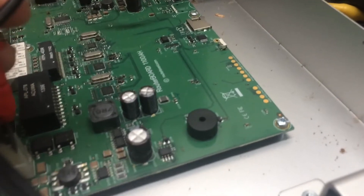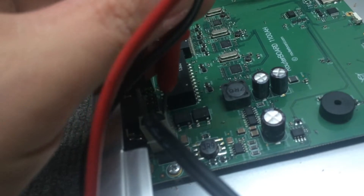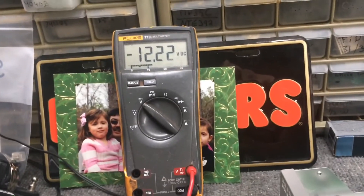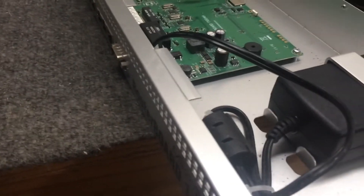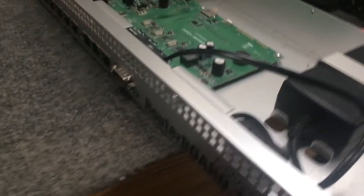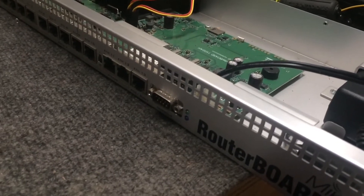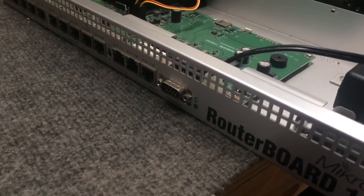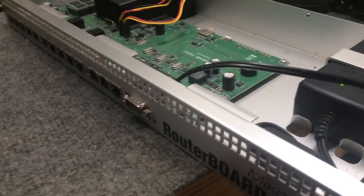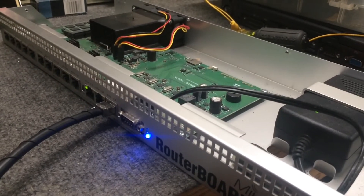I'll go ahead and stick the probes in there and show you we are getting voltage. We did a little bit of troubleshooting — we're getting 12 volts to the board but the board's not powering up. For giggles I started troubleshooting, thinking what's going on. I plugged in the POE to the front — no go. Then I thought about the tower location where you have shielded ethernet going to the grounding block, so I set up a shielded jumper and tried plugging into it with the power supply — and we get power on it.